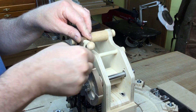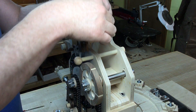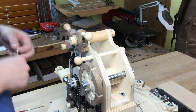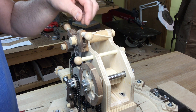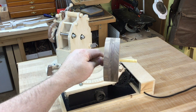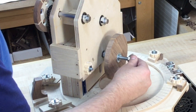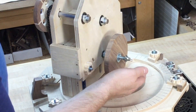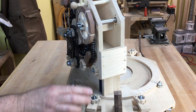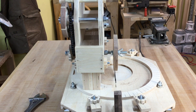Before fixing any wooden wheels onto the threaded rod I always detach and disengage the pin mechanism, because when I tighten that threaded rod with a wrench I don't want to put any pressure on that sprocket. To demonstrate, I'll be making this four and three quarter inch diameter wheel that consists of four wooden discs which I've already prepared. I'll start by making one of the outer discs that has these slanted grooves in it. Before I do that I want to calibrate this and put the wooden wheel onto the threaded rod and make sure that wooden disc is centered over the saw blade.